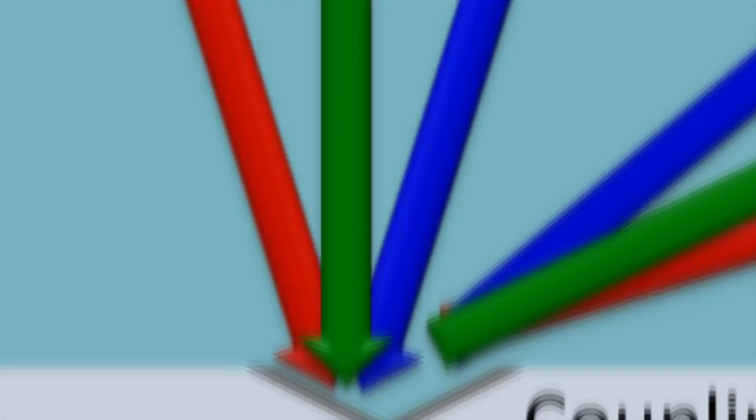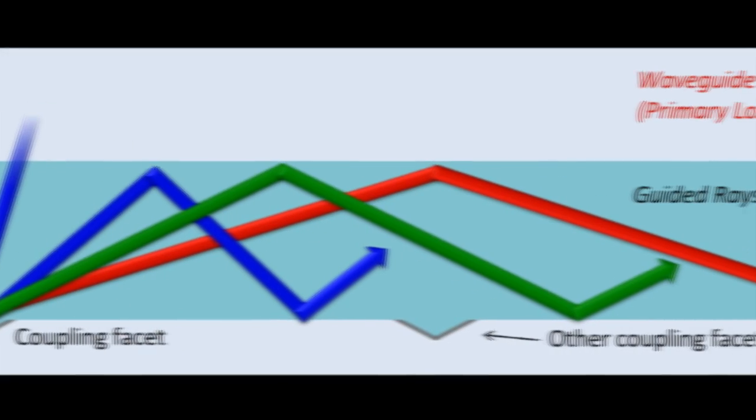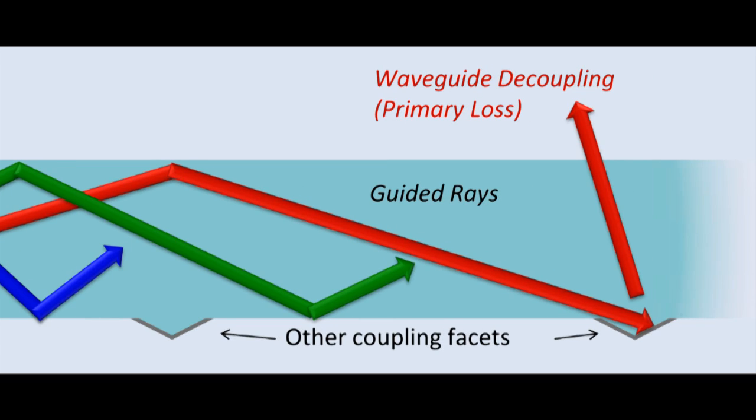At that location, that's where we're placing a photovoltaic, and this is going to be the device that actually converts that sunlight into electricity. So the path is a bit different in that it comes in from the top, and now it's getting moved sideways and being confined within a new medium — and that medium is this slab of glass — and that's the waveguide.